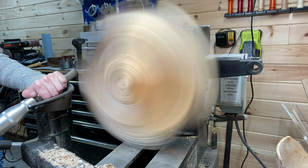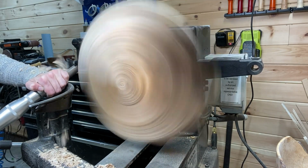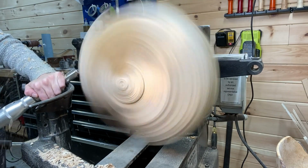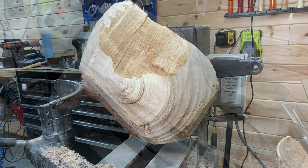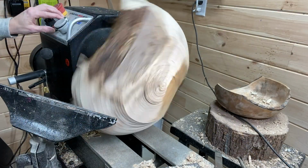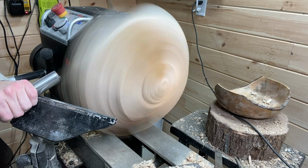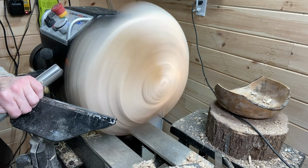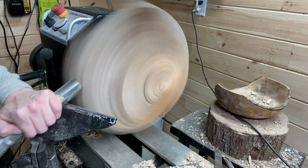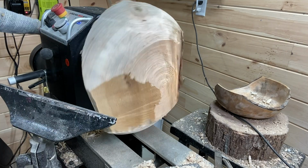And the RPMs on this right here was around 430, and the whole entire project, I don't think I got it over like 550 RPMs, because it was just odd shaped. It was never really truly in balance, which you'll find with a lot of the log to bowls, because they're not perfectly round cut blanks, which is part of what makes them a little bit more fun, in my opinion. The organic shape of the rim and what you can find inside an ugly log is fascinating.